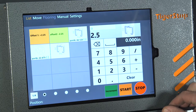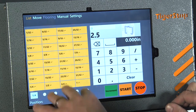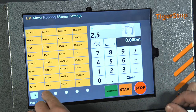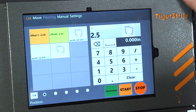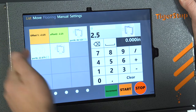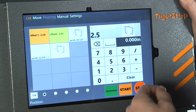This is where you're using the Tiger Stop more manually using Tiger Touch. Now we can program in offsets and we have a couple of fractionated offsets in the first screen here. We have multiple screens that we can go through to add our own offsets. As you can see, we have a positive offset of 2.25 inches and a negative offset of again 2.25 inches.